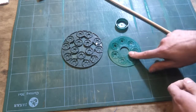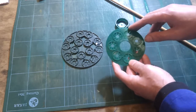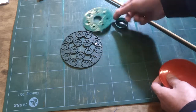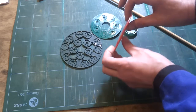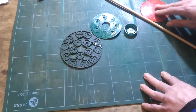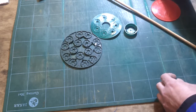One problem with recycled polyethylene is it tends to warp. This is because the outside circumference will shrink by about 1 to 2%, as will the inside, and obviously the outside is significantly larger, so you get more shrinkage, and it basically can't shrink flat, so you end up with a kind of Pringle shape. It's even more noticeable when you do something that is a complete circle, like on this coaster, and that's really bowed out in the middle as the thing has contracted. You can get around that by using slightly different materials, or just packing it and letting it solidify more in the mould, but basically you're better off just using something which doesn't do that.